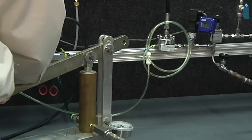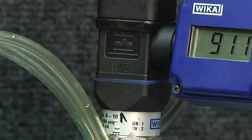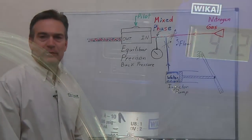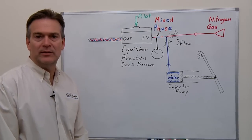The two phases will mix inside the regulator and you'll be able to see the foam and spatter on the low-pressure outlet going outside the regulator. What we have is a two-phase flow simulating a research reactor, where two phases pass through the back pressure regulator controlling it at nearly constant pressure.